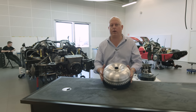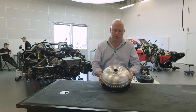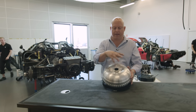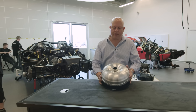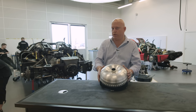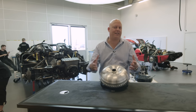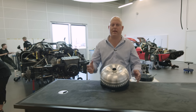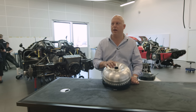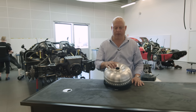Normally you would find a lock-up converter in an automatic transmission car. The converter itself without the lock-up function was invented about 100 years ago. It manages to convert more torque when driving slowly through a hydraulic turbine-like process. We know of no other hybrid car using it for a hybrid drive — it's old-school and unobvious in a high-tech environment. But it does really cool things that make the direct drive work well. We could use a more traditional clutch and still make it work, but we wouldn't be able to accelerate as fast while also achieving the top speed we have.